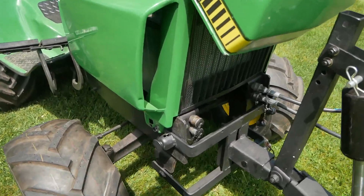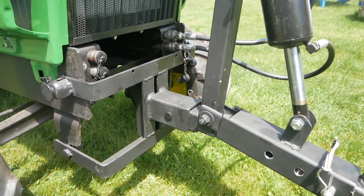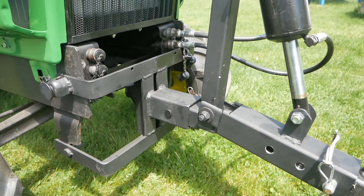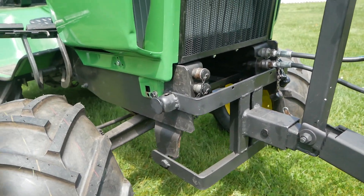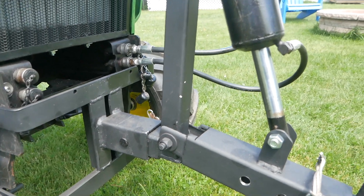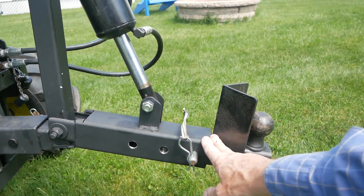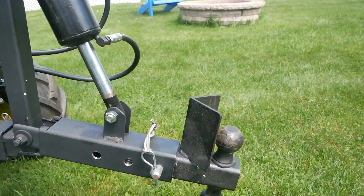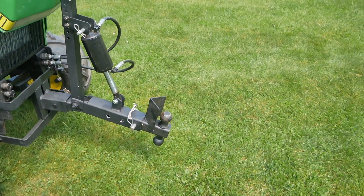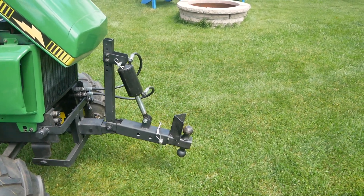On the front here, I built this little rack thing, and I can hook up a bumper hitch receiver right there if I don't want to use the hydraulic system — it just locks on just like the snowplow did, very rugged. I also have a small crane that mounts to this point here, and I put that 6,500 pound winch on the end of it. I can lift up 300 to 400 pounds with that crane on the front.